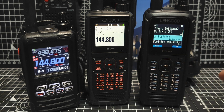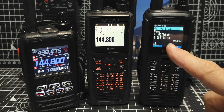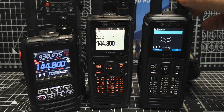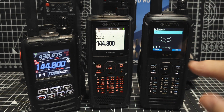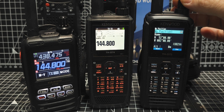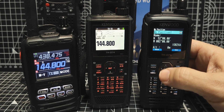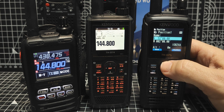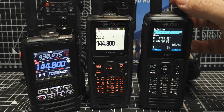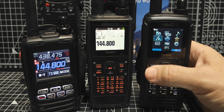Go down one and you'll see 'my position'. Don't press enter - press the right button, and it switches to my position. With the very top knob you can click it back one to choose GPS when you get a lock, and then select 'use'. Since we haven't got a lock, click it forward and leave it on manual position, which you type in by scrolling down, pressing enter, and scrolling down. Just type your position. Press the back button to go back, then press menu.